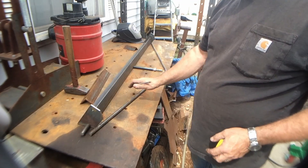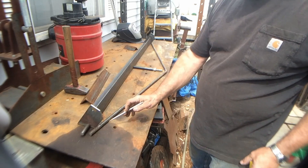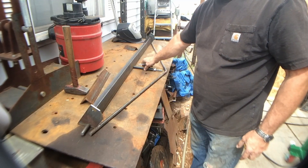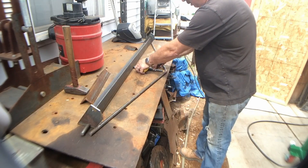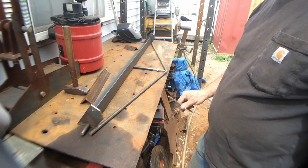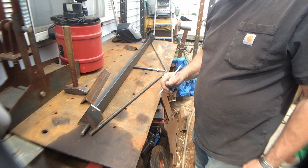So this is the layout — this is the back side of the leaf. This will all sit at an angle obviously. This is our tension rod on top. We'll trim these on both sides so it slides down in against the leaf and weld those solid. We'll weld our center tension adjustment on there, and weld it there and also right there. Basically the top leaf will be done — other than we'll have to smooth it up, round the edges, and get some paint on it.